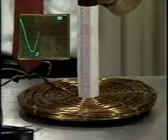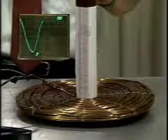Here, the coil center rises by 2.25 centimeters at 20 amperes RMS. We take other data points by increasing the current further.